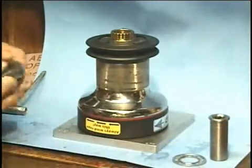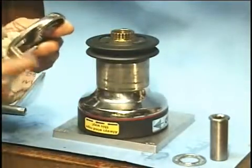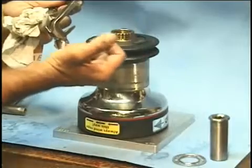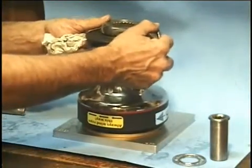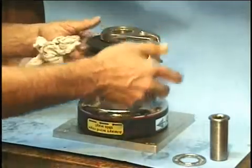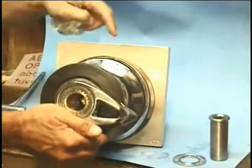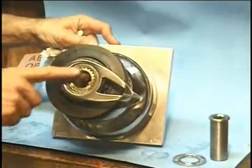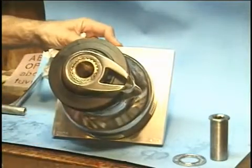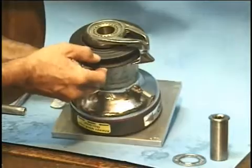Then we have to put the peeler arm on, and it's actually necessary to lift the drum up a little bit, because this finger on the peeler arm has to go between the two jaws of the self-tailor. The peeler arm has to be aligned so it's at about 3 to 4 o'clock on the clock face. Where the plate is marked 'top' — if you consider that 12 o'clock — the peeler arm has to be aligned at 4 o'clock. It fits on this spline, and that's very important.